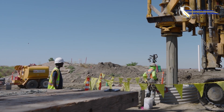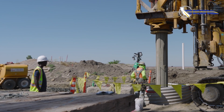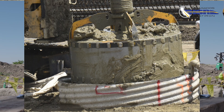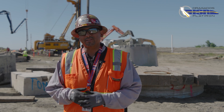The slurry is maintained 10 feet above the encountered groundwater in order to counteract the hydrostatic pressure. The slurry level is maintained at this elevation throughout the drilling and placing of concrete. When drilling is complete, the slurry is properly recycled and cleaned prior to concrete placement to ensure that any previously suspended solids are removed so they will not contaminate the concrete being placed.